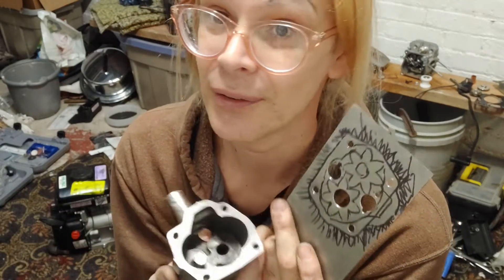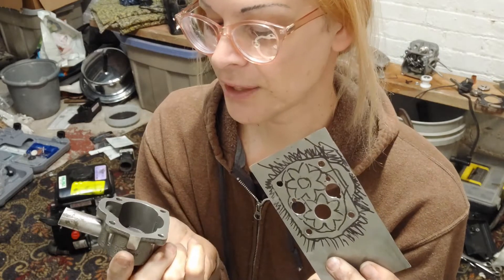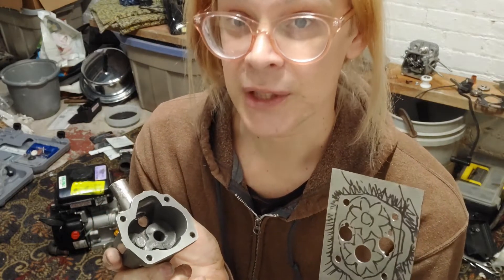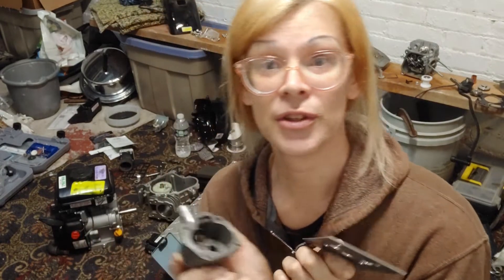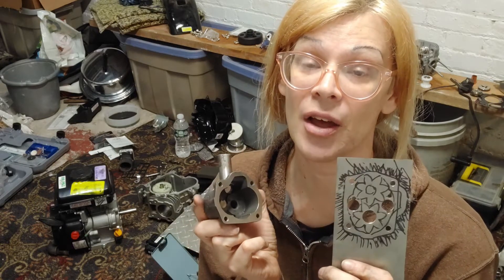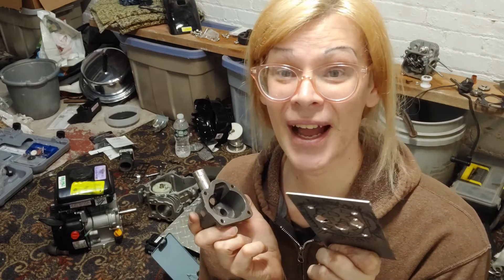How much? I don't know. But I can't wait to find out. I've got to wait for stuff to set, and then once I have that set, the shaft that goes through this housing — I need to cut a key into it, then I can clean up and start to assemble. Then I can put it on a test. For this test, I don't have to use the drill — the drill I was using in my first preliminary tests only went up to 1200 RPM. But now I have a die grinder with a dial, so I can dial the speed and potentially test between 1,000 RPM and 10,000 RPM. And that is going to be something to see. Stick around. Thanks for watching.